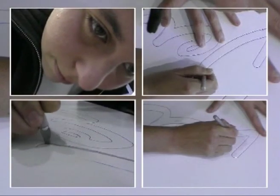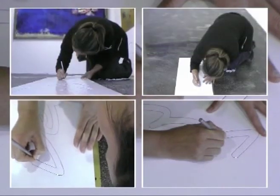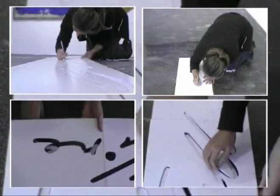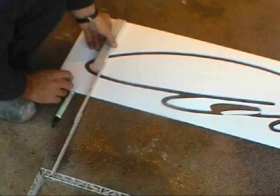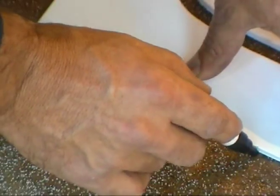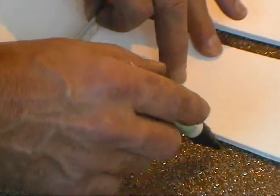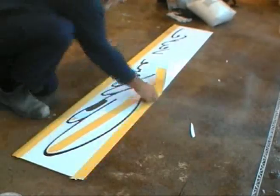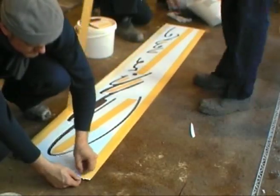When creating a logo or integrated floor design, you must first create a template or mold made of polystyrene or plastic. The design or logo is then placed on the styrene board, and the styrene board is adhered to the subfloor.